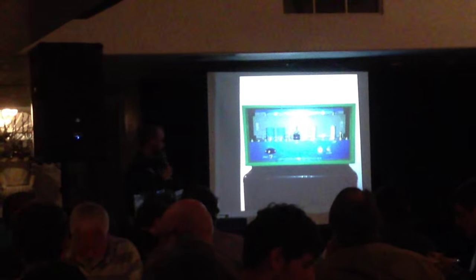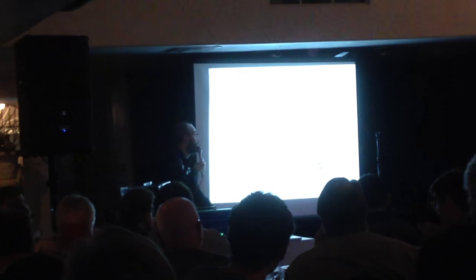So here's some inside shots. This is the driver stage right here. This is the back of the unit. And one of the other things that I wanted to bring to this circuit was a foot switch that controls the reverb. A lot of reverb units, if you're a guitar player, you might be familiar with this, when you turn the reverb on and off, you lose the tail of the reverb. It actually shorts the reverb out to ground. And I endeavored to come up with a foot switch circuit that just kills the drive to the reverb, so you don't lose the tail of the delay, right?